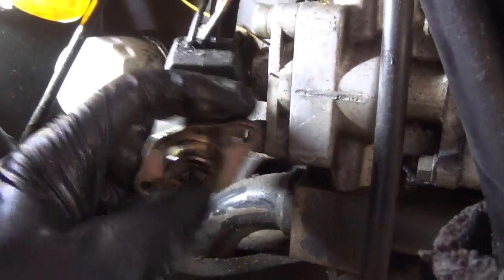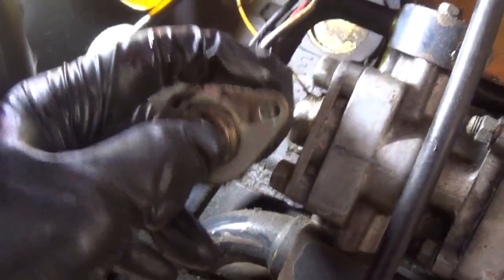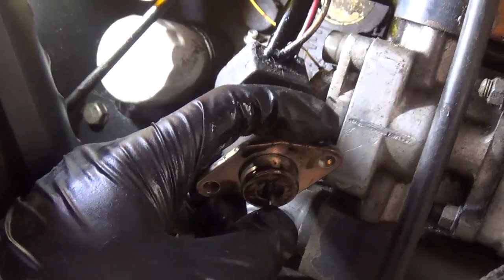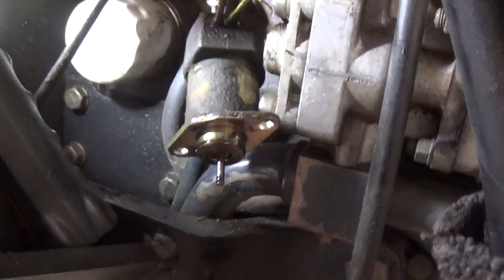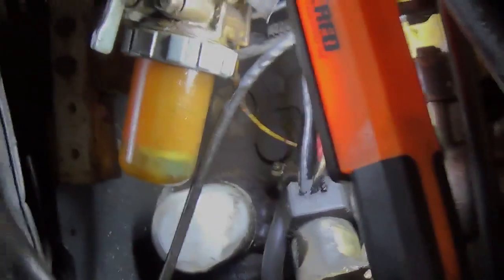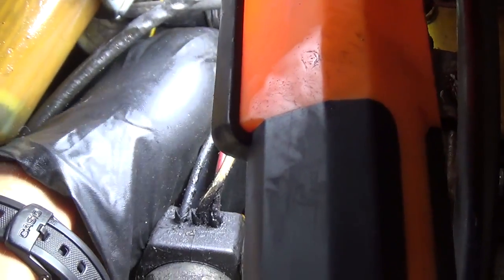So maybe we can bypass this thing. If we take this out — I want to see what's inside — but if this doesn't need to seal the actual fuel, we can turn the key on, push it in with a finger, and then reinstall it to make the tractor run and prove the concept. We just need one of these parts. Let's crank it — to shut it off I'll need to push that plunger in with my finger. I'm just hoping the fuel won't spray everywhere, but if it does, it's alright.